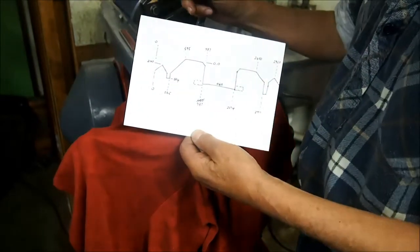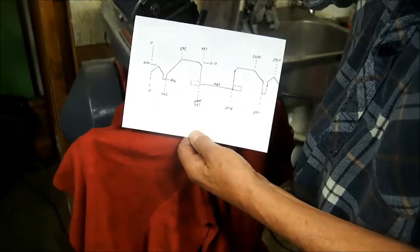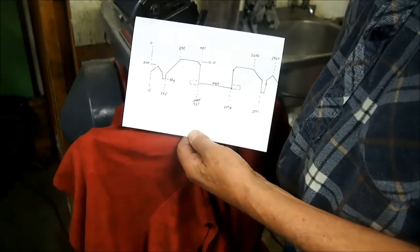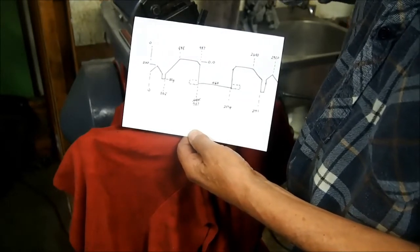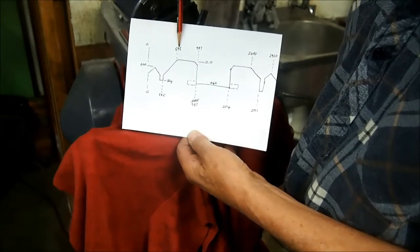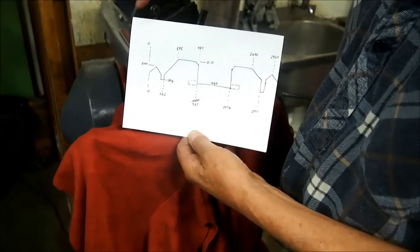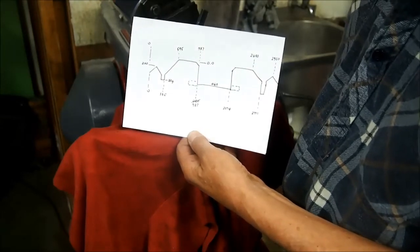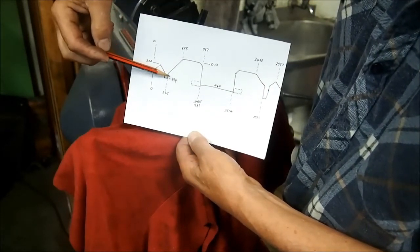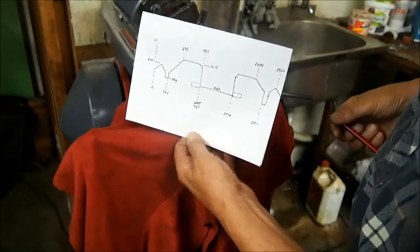We're in thousandths of an inch. Somebody made the comment that most of the world still works in thousandths, and this shaper is in thousandths, and I'm comfortable with thousandths. I'm old enough to have been brought up in inches and feet in my early school days, and then the rest of my life in millimetres, so I'm reasonably comfortable with both. So: zero, zero thou; 500, 595 thou; up to 2.9 inches — all in thousandths, no sixteenths or sixty-fourths or thirty-seconds. This line here is zero in this direction, so that's 200 thousandths deep there, and the bottom of that groove is 324, for example — and we did that measurement on a surface plate.